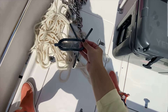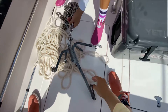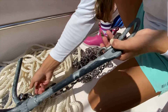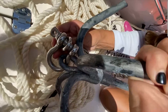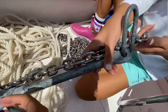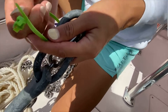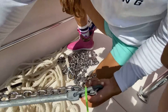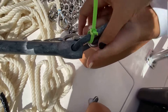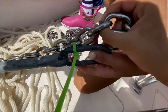I'm going to show you — basically it tripped. So when it was in the water, before we dropped it over, it was not like this. We have our grapple anchor set up with a shackle on the bottom loop, right here. The chain is going to come up the anchor. Then you're going to zip tie your chain to your anchor up here, just like that. And that's how we have it rigged when we toss it overboard — zip tied to the anchor, attached at the bottom of the shackle and zip tied at the top.